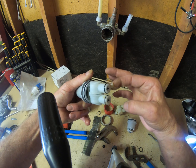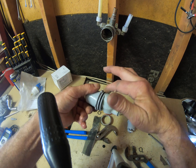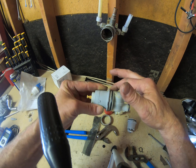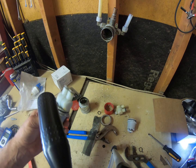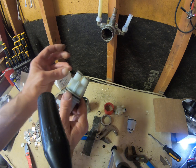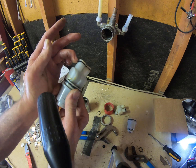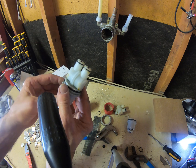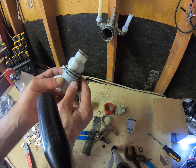So if you don't, this O-ring is going to roll back, snap, crack, or whatever. You want to get some on this end too. Just like that. So far so good. Now if you don't, that O-ring is going to roll down like this, watch. See that? You don't lubricate though, that O-ring is going to slip, split in half and you're going to have another leak again. So lubricate these up really well.